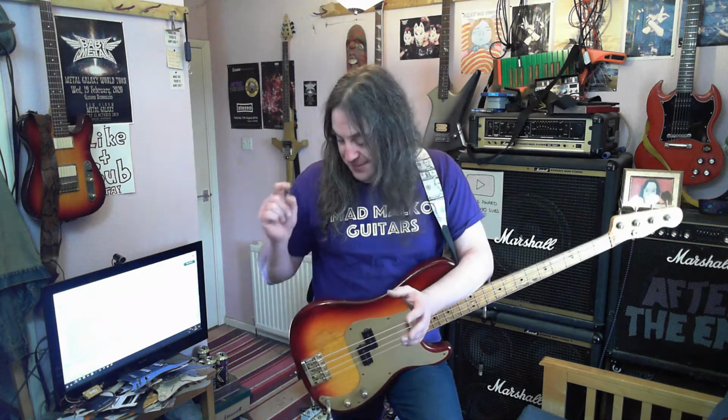Also, it might have a use if you've got some crazy wiring, like I just did a Strat yesterday with phase sounds in it. When the two pickups cancel out, it's a really thin wiry sound. It's also a good bit quieter. If you really like the phase sounds but you wish it wasn't quieter, you could have that boost thing, so you put the phase on and put that boost on and it would probably bring it up.